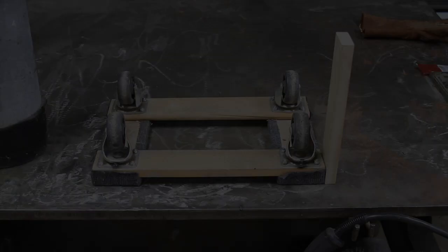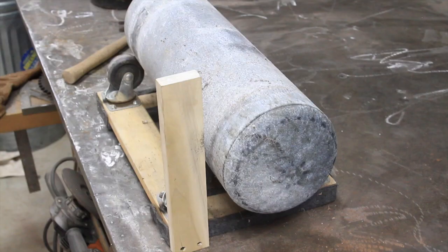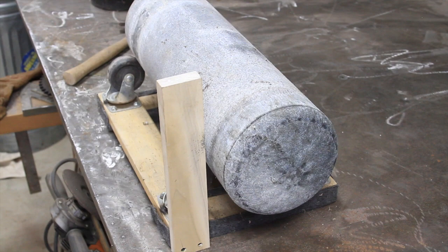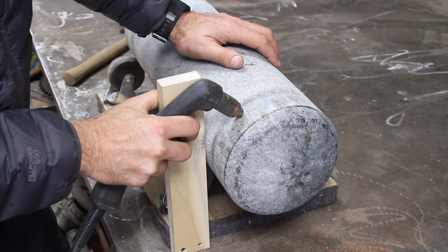The last thing I didn't film right in the last video was to show the contraption I've made to be able to cut the bottom off of my tank. I use a plasma cutter to cut my tanks, and all it is is a dolly that I've flipped upside down and tacked the wheels into place so that when I put the tank on it I can spin it. Now that the tank is inside the cradle and able to spin, I've taken my plasma cutter torch and made a block that I can sit up against — it gives me something to hold it against so that when I rotate the tank it stays in one position and makes a clean, even cut around the base of the tank.